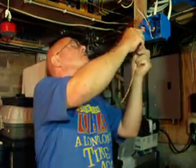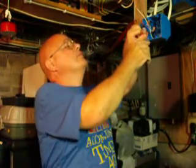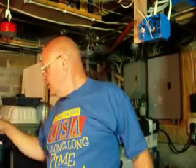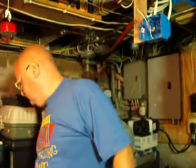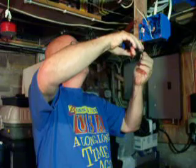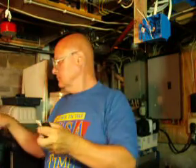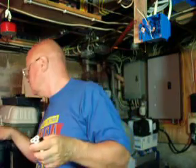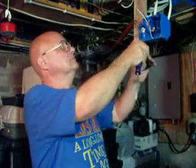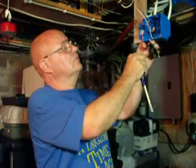So I'll show you a little trick with this tail here — push it in. Make sure all the copper goes up to the top of the connector so you've got a good contact there. So first we'll hook up our light switch. We'll make a loop in our ground wire here, and go around the screw like that.